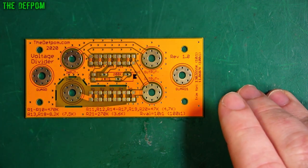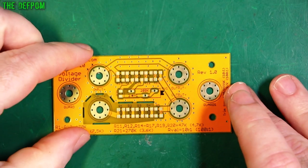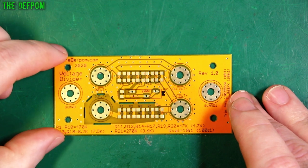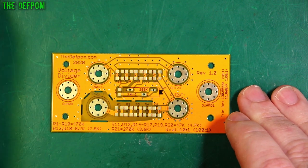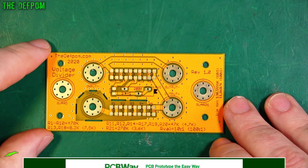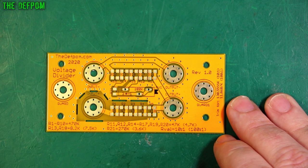Because I have something like the PDVS2 Mini from Ian Johnston — I highly recommend you get one, links are in the description — you can quite accurately calibrate your DC calibrator, obviously within reason and tolerance. It's not perfect but it gets you pretty close. You can then use that to calibrate your multimeter. My Fluke 343A for example is quite good; I can do basic calibration with the PDVS2 Mini, and because it has dividers built in, the Fluke will actually be more accurate by dividing down.